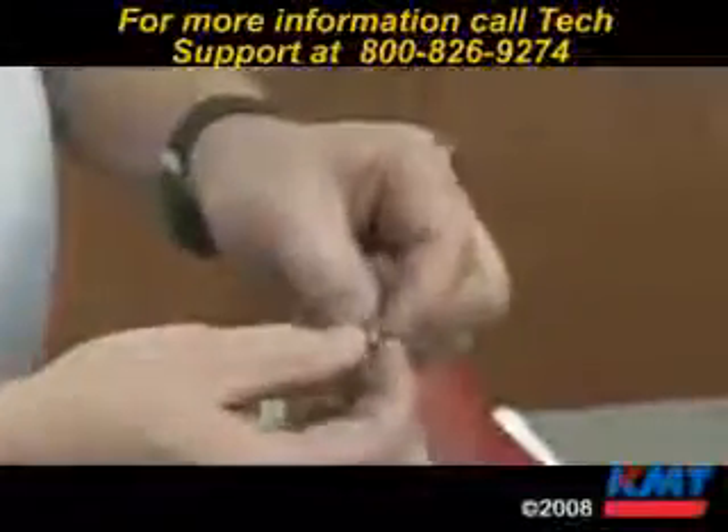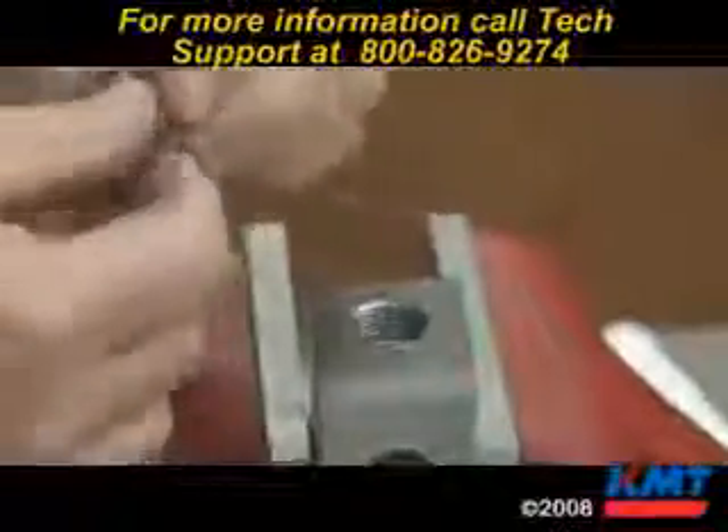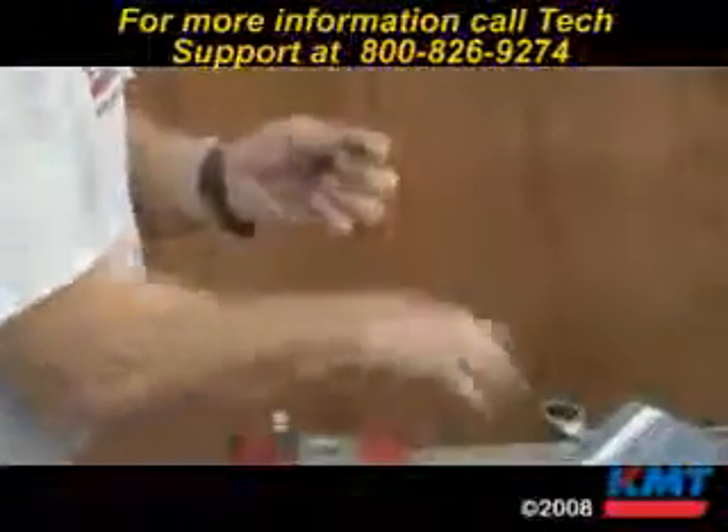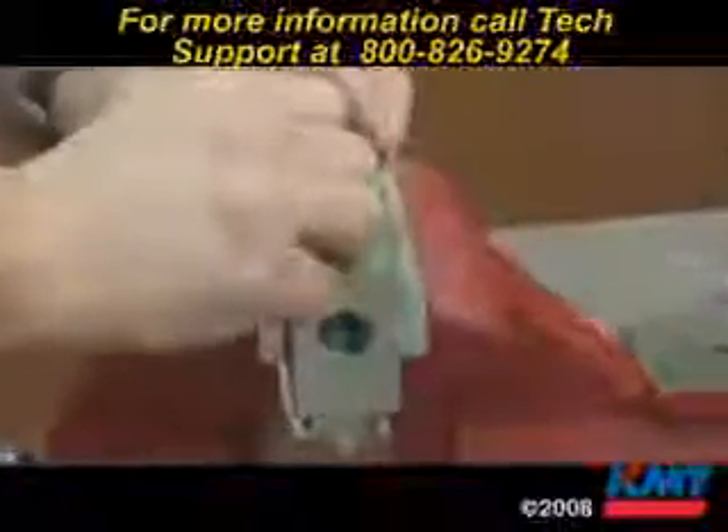On the new stem, put the O-ring. Notice the position of the stainless backup ring with the groove going away from the O-ring. Then place the little brass backup ring with the step facing the wedge ring on the seal. Put a little grease on the stem and position it down inside the seal assembly. Push it down.